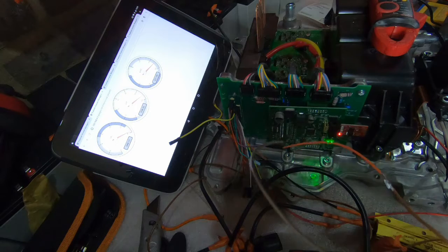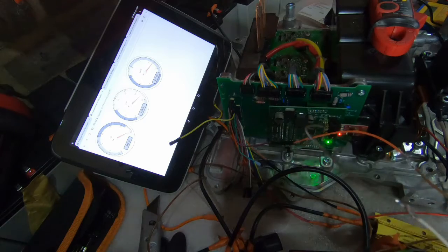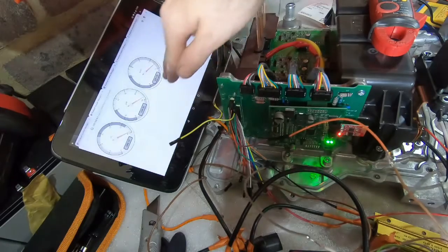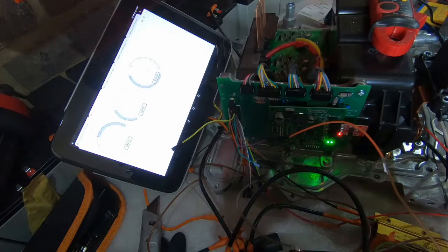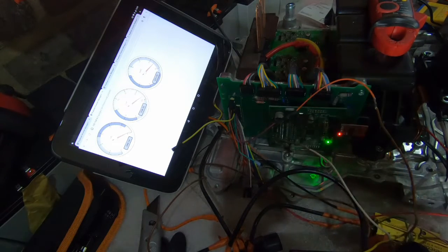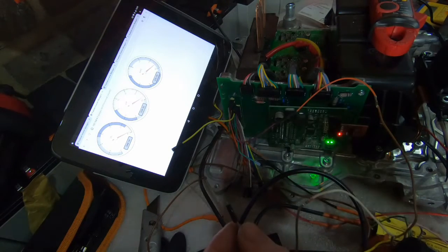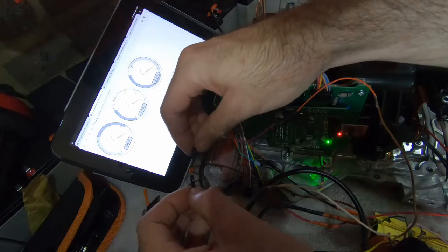Alright, so here we go. We've got the inverter switched on, but no power going into the capacitor, so anything we do shouldn't blow things up. So it's reading its baseline voltage, and then we've got 2 potentiometers, so basically the 2 throttle signals, and they're just showing values. They're an open wire, so who knows what's going on to it. So I'm going to connect the signal wire for the accelerator pedal, which I've already connected the 5-volt and ground to. Let's see what happens.